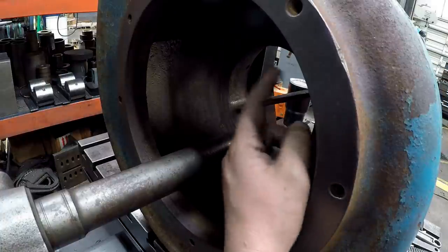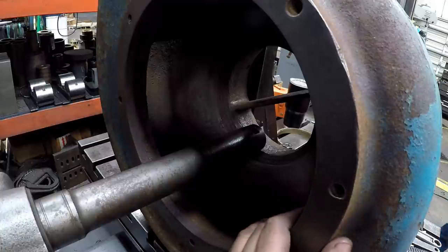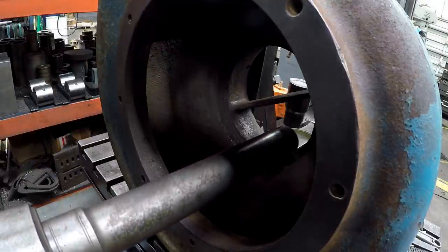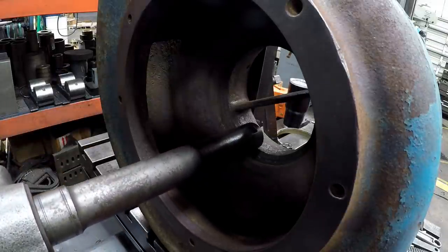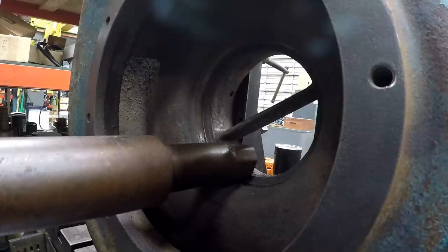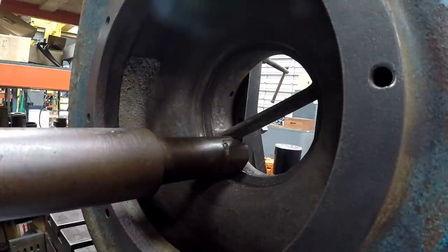After I did my indicating on the outside, I went in there and indicated the bore — it was bouncing around within five thousandths of what I had indicated out here. I went in with my tool bit and boring bar, rotated it around until it touched, and tweaked the Y and Z axes until it was just touching all the way around — about two thousandths each way, really close. I had to switch to a different bar because I couldn't get deep enough to the shoulder with the first one. This bar has the tool almost flush with the end. I'm establishing my shoulder right now.